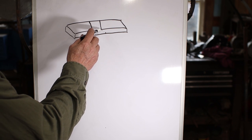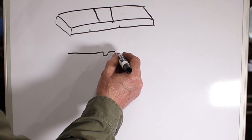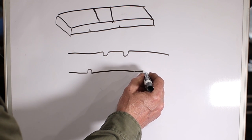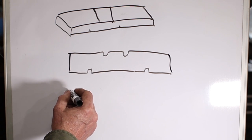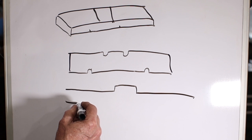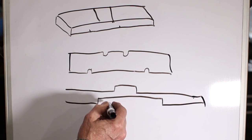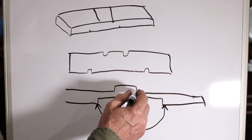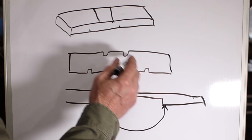The reason we've laid this out on the other side, and the reason I put little grinder marks in there, is so I can index and fuller in here. I want to put a little fuller in at both of these marks. When we actually forge this, we're going to thin this out between these fullers, and we want to end up with a piece that has a raised section on one side and then at both ends. This is the part that will become the eye — when this wraps around, this will touch this. This is the pole of the axe, and this section is thinned out to become the eye. That's why these are laid out on opposite sides, and you have to make sure you don't mess these up as you draw it all out.